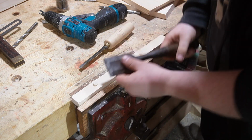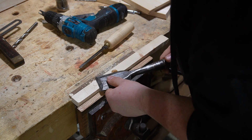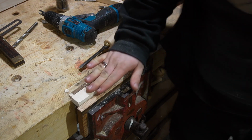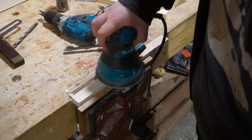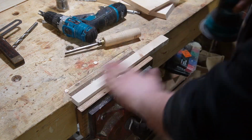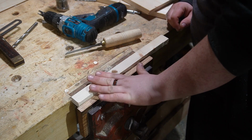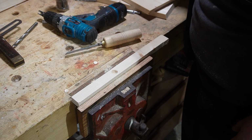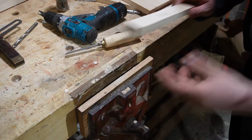We'll come along with a chisel, cut it off. And this spreads out a little bit as it's glued. I want to give it a little sand. End up with an almost invisible finish. So that's what I want to use on this for all my attachment points. So when I screw through the sides and when I screw through the top. So let's do that first.